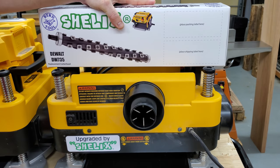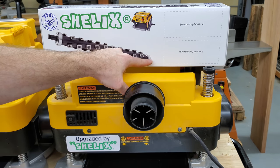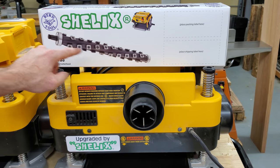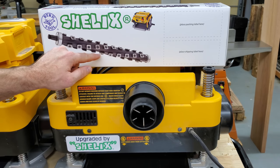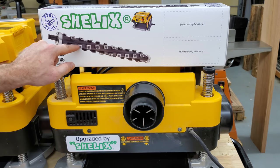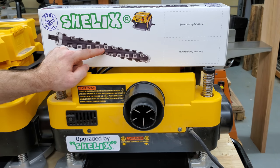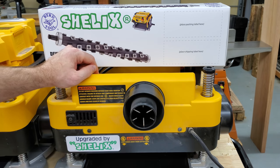Now, the reason that there are two different sizes is that when you're installing this thing, it slides in that way. You slide in that bearing through the opening for that bearing. And then all of these cutters have to pass through the opening that's going to hold that bearing. And this diameter, and the diameter of the original version, is a little bit larger than that bearing. So that means that you have to remove all 40 cutters from this thing in the OEM version before you can install it. And then you have to reinstall all 40 cutters after you install it. And some people find that to be a huge pain in the neck. So they make a slightly undersized one, and that's supposed to allow you to slide this thing in without having to worry about removing all of those cutters and reseating them properly.